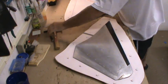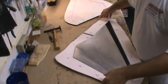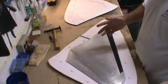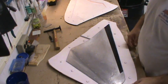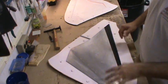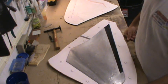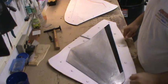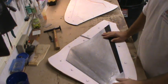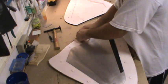As I mentioned in one of the other videos, this resin puts off a pretty noticeable amine blush — that really waxy layer. To get rid of that I just took a red Scotch-Brite pad, trimmed up the edges, hit it with a belt sander to smooth everything down. Then I took the red Scotch-Brite pad and a garden hose and just scrubbed it down, and it gets rid of basically all of it.